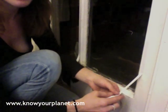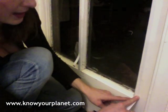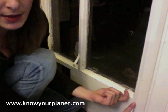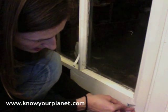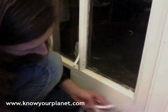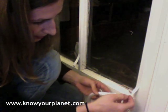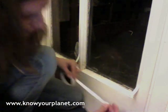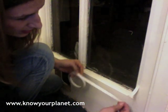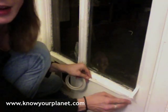One piece of advice I'd like to give: when you get to the corners, make sure there's no air that can actually go underneath the film. You want to run down the double-sided tape just a little bit further than needed, cut it off and then actually peel off the corner. Peel it off, lift it up, let it hang, and then actually attach the double-sided tape for the horizontal line on top of it. That makes sure it's going to be a very airtight corner.